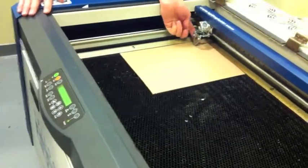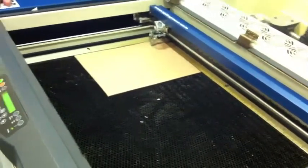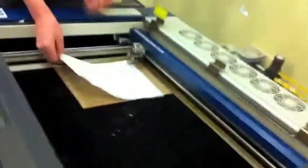Visually, you will start to see this focus gauge move forward and up. But you want to catch the very, very first movement, and that can be a very subtle cue, particularly late at night. So I tend to recommend the tactile method. Cheap feeler gauge, just wiggle a piece of paper until you feel resistance, then you're at the right spot.